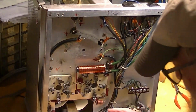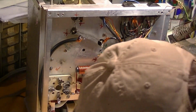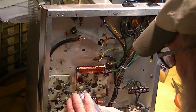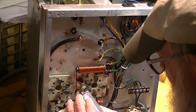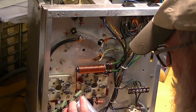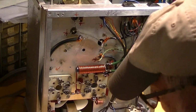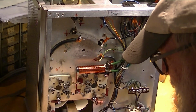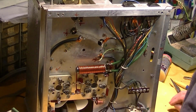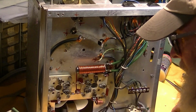That was simple. And what I want to do is disconnect these capacitors from each other just enough so that I can take my, let's see who made these, very high quality, micro EMF it says, or synchro EMF, 200 microfarad, 450 volts. So these are very high quality capacitors, and they're often replaced unnecessarily. At least in the SP200s they are. And I don't know about these because I've never had this amplifier before.